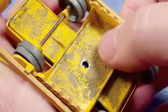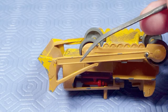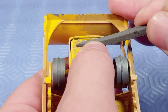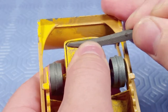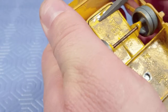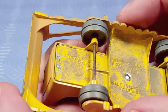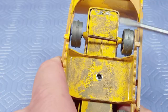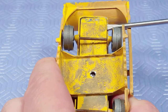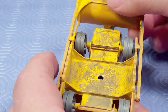The rivet comes off but the front thing is holding it in. I'm going to use a riffler — this is a small toolmaker's file — and it lets me get into a tight spot like that and take down some of the material to make it easier to remove. I want to take off the surface and then try and pry it out of there, and when I pop it back in it'll still have friction. Get a screwdriver in and there it goes — that'll leave me enough material that in the end I can push it back in.